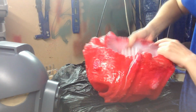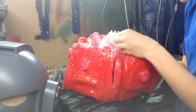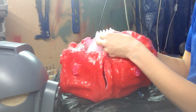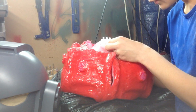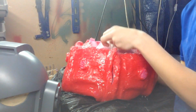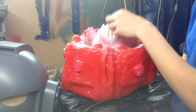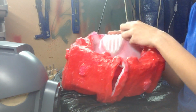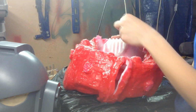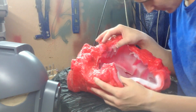The grill turned out pretty good. I was really worried about air bubbles in the top. There's this one right here, but it should hold for a good few pulls. If not, then it just means you've got to Dremel out that little bit. Wherever the air bubbles are, plastic will seep into it, and it usually breaks the mould, stretching it a little bit. So you've got to be a bit careful of them. But it turned out pretty good.